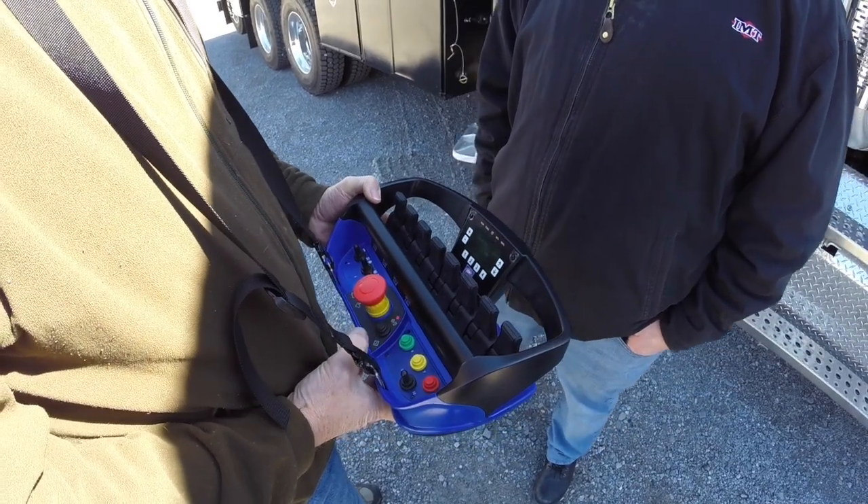We will go over a couple of things you will see in the display. Error code 001 is when our E-stop is pressed in. Error code 180 or 'No RC' is if the transmitter is not turned on.